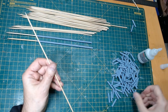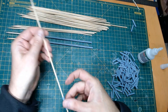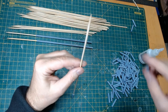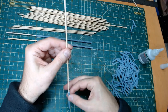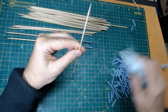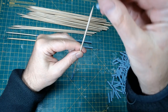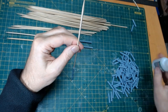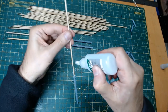The bars that come down from the ornate window details at the top have been 3D printed in individual sections and need something strong down the center to give them enough support. This is actually the third attempt — the first time I printed them with far too thin a wall and they almost crumbled in my hand. The second attempt worked, but the hole was sized for piano wire which I couldn't get in straight lengths locally. So I remodeled them with a larger hole to take some barbecue skewers, which worked perfectly.